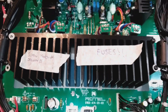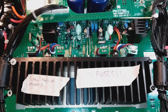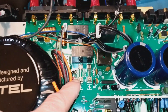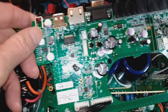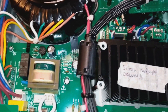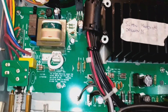These are my labels. One of the things I do when testing an amp — there are a couple of 6.3 amp fuses there, so I actually replaced them with 2 amp fuses while repairing it, just in case anything nasty happens and the fuse will blow. We've also got a sort of power supply over here, which is the standby circuitry.